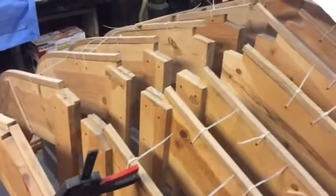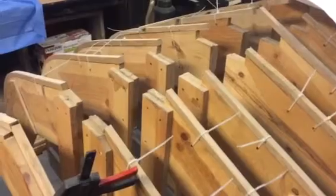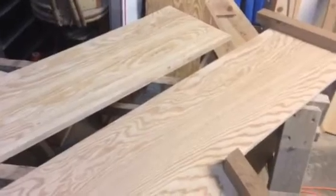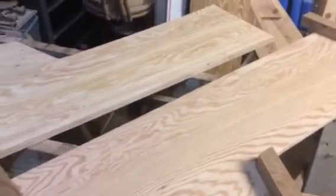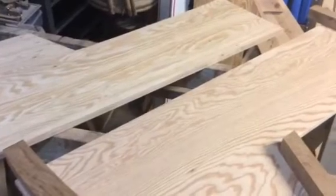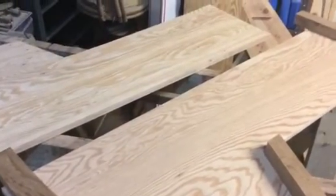I think it's going to fit in there fairly tight because it's three inches and nothing. I am going to epoxy the insides of this centerboard trunk, make sure it's watertight, seal up the edges, make sure we don't have any way for any moisture or water to get in there.